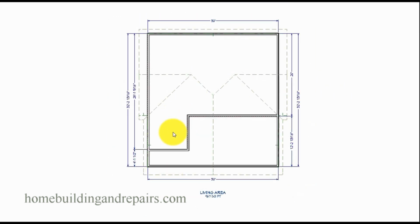Now, the individual who sent me the request had a building that would have been shaped something like this. It had a pop out on the end and a gable roof at this end. It looked like someone had added something on to it, like a porch or something. And in that section of the roof, you might be able to leave it as is and just frame over it. If not, just remove the sections that you can't. You could probably leave the ceilings intact and then just frame the new roof.